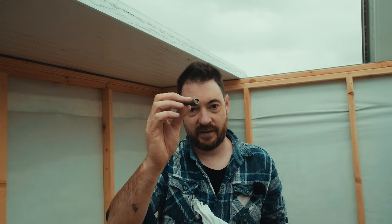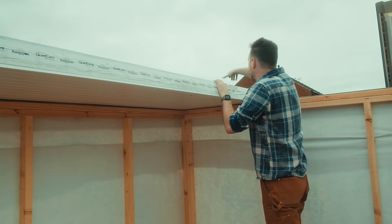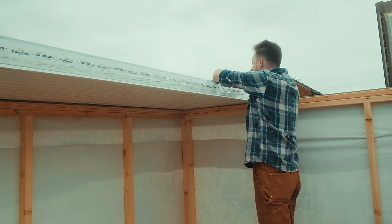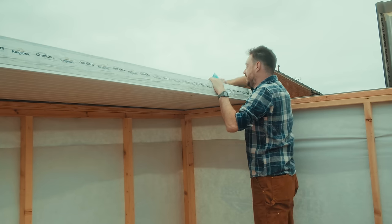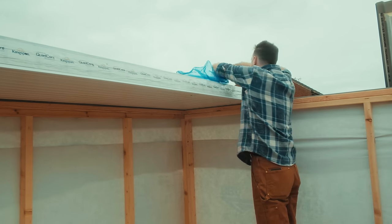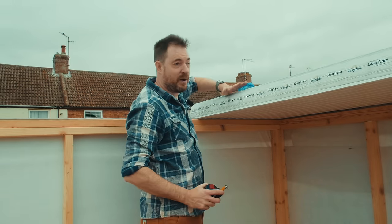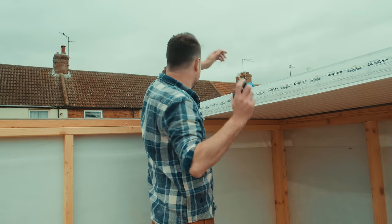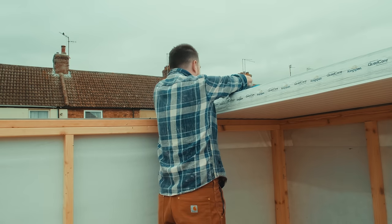That was not as bad to get on as I thought. I've got the overhang how I want it all the way around, and I think the first one's the hardest — after that you can just line the next ones up with it. The installation pack comes with these long self-tapping screws that have sealing washers on and a driver bit for the impact driver. I'm going to get a few screws in just to lock this in place so it doesn't move when I get the next panel on. Before I can get those screws in I need to get the protective film off — for the next ones I'm going to get it off on the ground because that's much easier. The screws need to go into the ridges, but not the first one because that's where the next sheet is going to overhang. I'm going to measure from the edge the position where the screws need to go, then use a centre punch to mark it, then drive them into place.